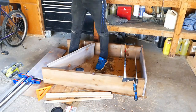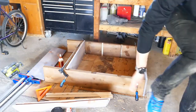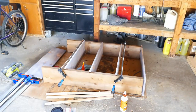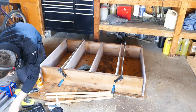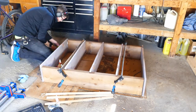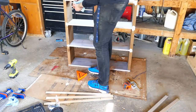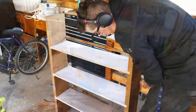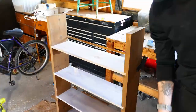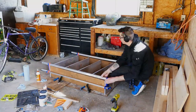For the glue-up, I laid everything down on the floor. I glued and clamped the three middle shelves to the sides at the same time, then pre-drilled and screwed the bottom shelf in. This saves time from having to glue and clamp all shelves simultaneously. The screws hold the wood in place while the glue dries, and the screw heads aren't visible from the bottom anyway. During a glue-up the wood can shift just a little bit — I just grabbed a block of wood and a hammer and tapped the shelves until they were flush at the back.